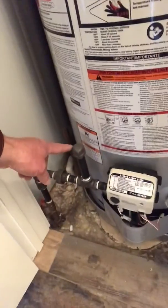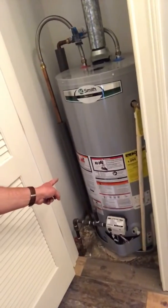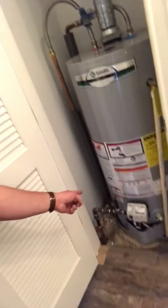Number 2, or 20, we want to have this drip leg actually drip with gravity. Gravity down, drip leg up. Not good. So somebody, I don't know what to say. Plumbers. They're usually good. And no offense to plumbers, because you guys are great, but come on. So those are just some issues with the hot water heater here.